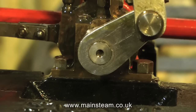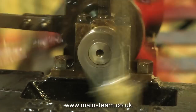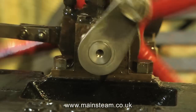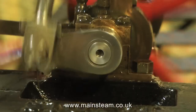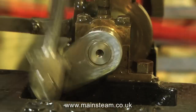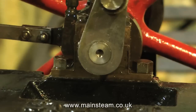This is what I found. When I looked at the crankshaft, I did notice there was something wrong with the crank web. If you look at the video currently running, you'll see that it's been sleeved. The original builder bored out the crank web to the same diameter as the crankshaft, and then realising the mistake, he sleeved the crank web so it fitted on the recess part of the crankshaft. Once he'd done this, he cross drilled the crank web all the way through the crankshaft and fitted a pin.